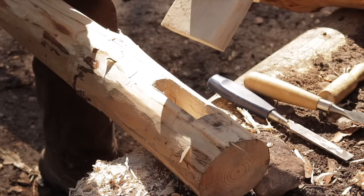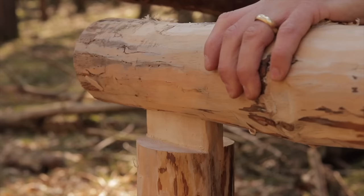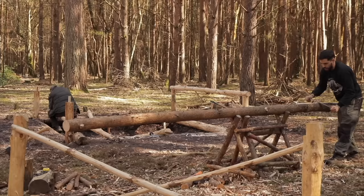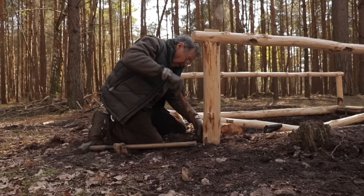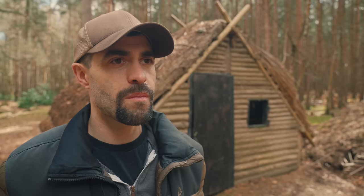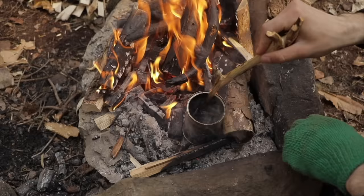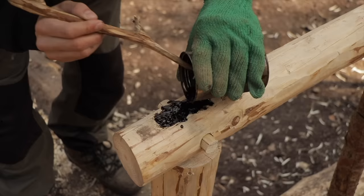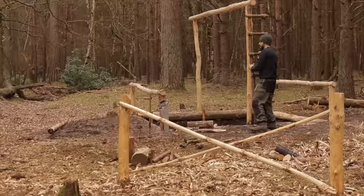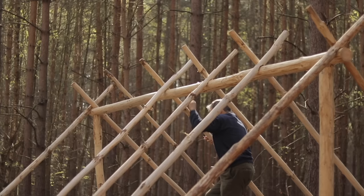We dug the pit - quite a labour intensive job but good fun - and then made a timber frame using pine. The woodland behind me is full of Scots pine trees and where they're so dense they've grown lovely and straight, so we had great pine resources. We peeled the bark off using a peeling jig and a draw knife to reduce the chance of bugs eating under the bark. I made some mortise and tenon joints, and we sealed them with pine pitch - the resin from the pine tree melted in a tin. In hindsight I would have made the tenons go three-quarters of the way through rather than all the way through, so the top of the joint stayed protected from rain.